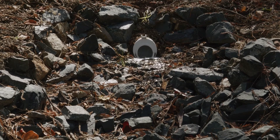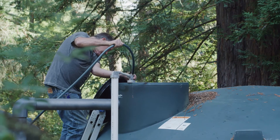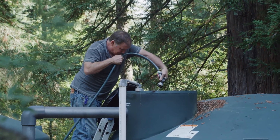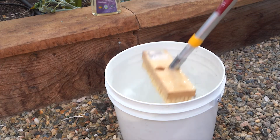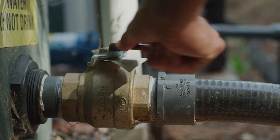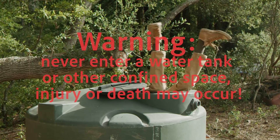If you see erosion, add some more rocks to the pad. Monitor the tanks to ensure that fine sediment is not building up, algae is not growing, and insects have not gained access. Clean tanks at a time when minimal water is stored in them. For sediment buildup, use a hose to fill a few inches of water in the bottom of the tank to flush sediment through the tank outlet and drain. For algae, use soap and water to scrub the inside of the tank with a brush or sponge. Do not use bleach. Flush tank cleaning water through the system drain. Use the isolation valves to take one tank offline at a time. Tightly secure the lid after cleaning. Never enter a tank or other confined space — injury or death may occur.